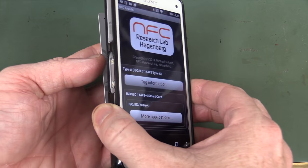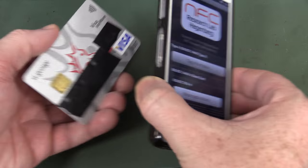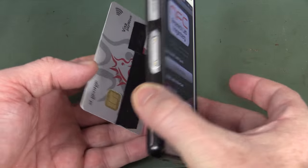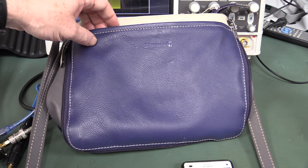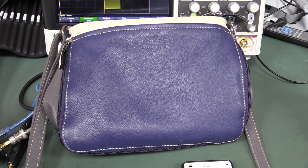You don't actually have to have them touching - you can have them a distance apart, though there is a limit due to transformer action losses since it's a pretty poor air-core transformer. The idea behind these shielding bags and wallets - does it work? It's not hugely hard to shield against this, but as I said, it's not a Faraday cage issue and it's not an RF issue - it's a magnetic field issue. Ideally you'd want what's called mu metal, which actually shields out magnetic fields.